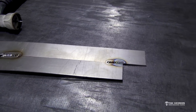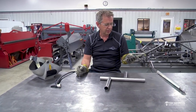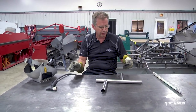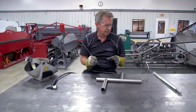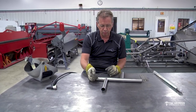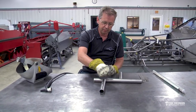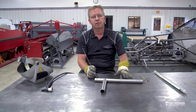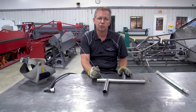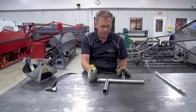I've got some tubing here. I'll make a few welds on this tubing just to show you what that looks like also. This is just like 4130 — it just takes practice. If you get a good cup and you get your argon flow good, one thing is you don't want to do a lot of welding at one time. You don't want to weld this whole tube together. You want to put enough weld on here that you can cover it with your cup, then stop and come over to this side and weld some, then connect these together, then go over here and weld some. You don't want to blow this whole thing together, otherwise you're gonna get the whole tube too hot and it'll be too hard to keep the argon coverage on it. So you have to have a little more patience and not make a real long weld.